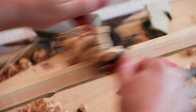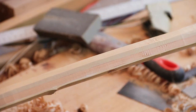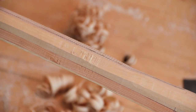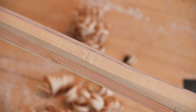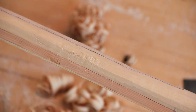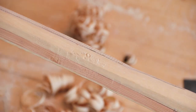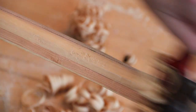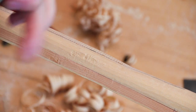Those of you with eagle eyes will spot that towards the handle there, on the right hand of the shot, it is starting to what we call pick up. There's a bit of a problem with the grain - a swirl in the grain - and that's starting to gouge out material, which obviously can be dangerous. Once we cut the bow into this shape, it's very near the finished shape, so you really can't afford to lose any wood. So I'll set down that bladed tool, the spokeshave, and I'll use a rasp instead. That's going to be a lot safer and much less likely to gouge large lumps of material out of the bow.